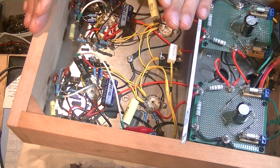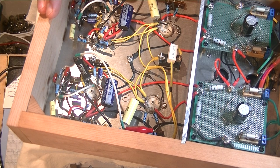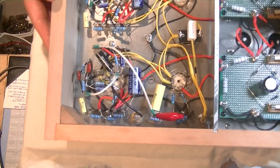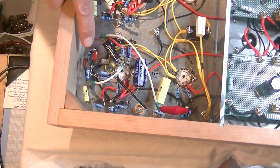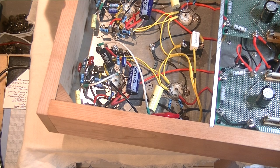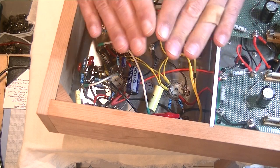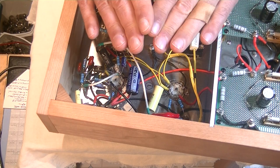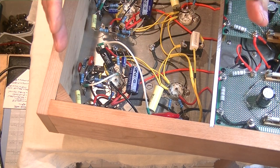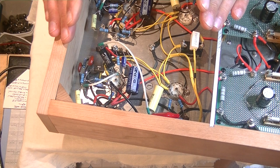With the high output impedance of this circuit, what happens is you basically turn the RCA patch cord into part of the EQ circuit, and let's just take a quick look at that. This little section over here, two capacitors and a resistor, is the whole EQ section. And of course, when records are recorded, the bass is substantially reduced, and the treble, for purposes of noise reduction, is greatly increased. And record styluses can follow high frequencies quite easily, but have a hard time with those low, slow waves, especially when they're mixed up with the rest of the music.